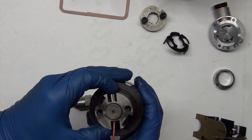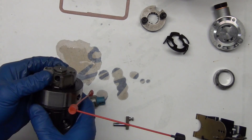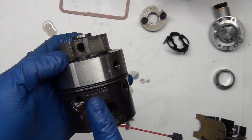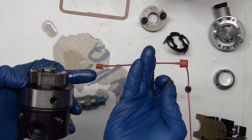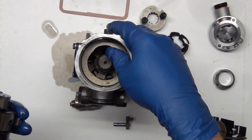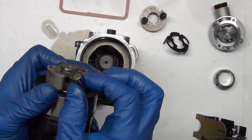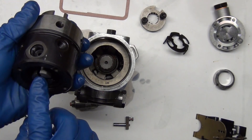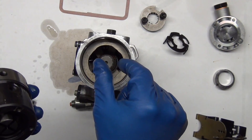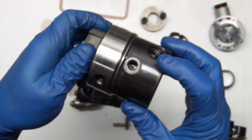You can see one of the plungers is pushed through the other side — they are super, super precise fit. As this rotates around, the plungers are tapered a little bit. The transfer pump sends fuel through a little hole, which separates and pushes the plungers out. Then they rotate to the cam, and the cam pushes on roller bearings in the shoe, which pushes the plungers together. This pump delivers 25 to 125 psi depending on RPMs — pushing the plungers apart, then the cam squishes them together, over and over, distributing fuel pressure to the injectors.